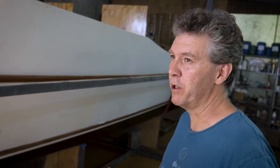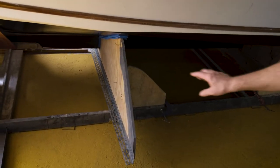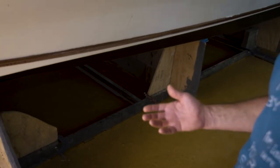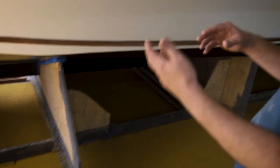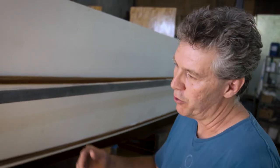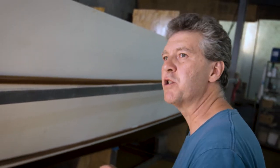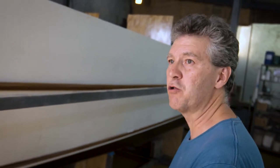To start well, you need a good foundation for the boat. This is the structure that you can see on the floor — this grey structure. It gives you the level of the boat. Everything that is going to be built on the boat is going to be built on top of this. So you have to make it very level on both sides, and the distance between the bars must be exactly the same, because everything will be based on this structure.